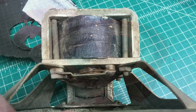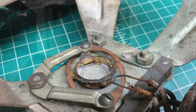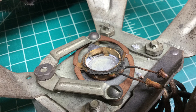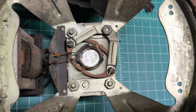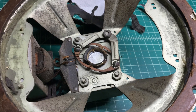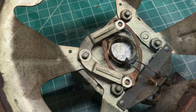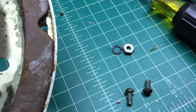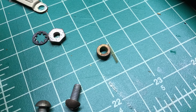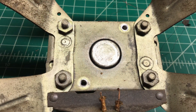So here we go again. I've done this on the Shanticleer 2D570, so I'll attempt to create another voice coil, wind a new voice coil, recreate a spider, and then reinsert everything into the speaker, re-con it, and see what we get. A few up-close photos here of the voice coil, the spider, and the associated hardware that keep things together and keep the voice coil centered around the center pole piece.